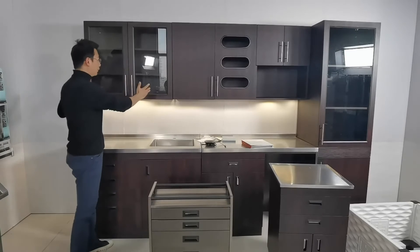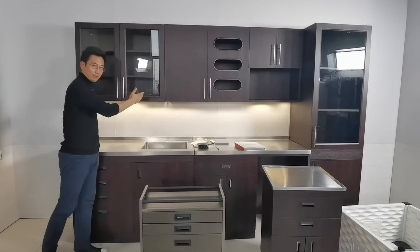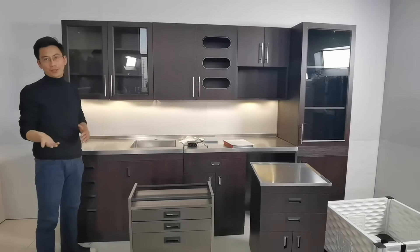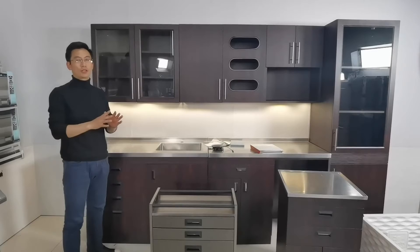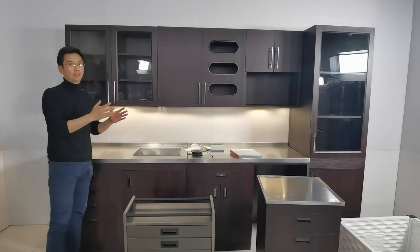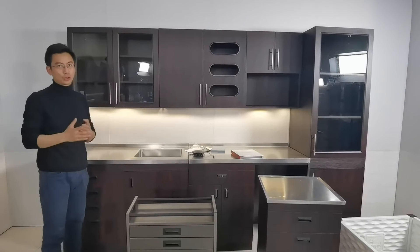For example, for the upper cabinets, we would cut in increments of every 6 inches — from 30 to 36 to 42 to 48. We don't want to encourage sizes like 47.5 inches, as that would make a lot more trouble and slow down the whole production line. Semi-standard sizes are going to help us speed up our production and sourcing powers.